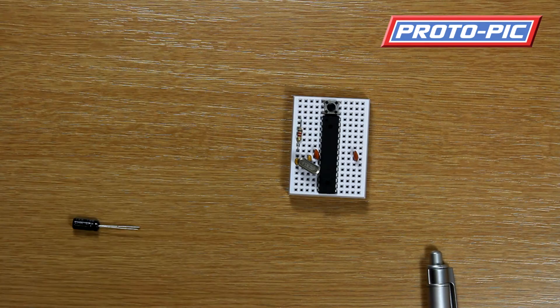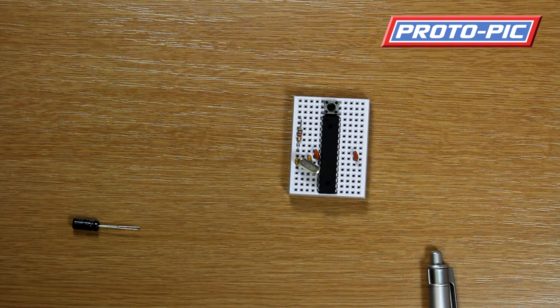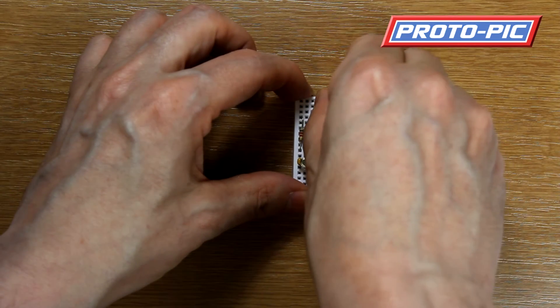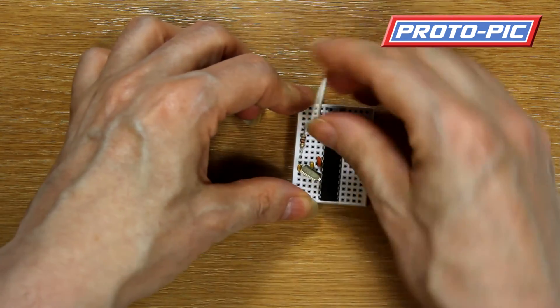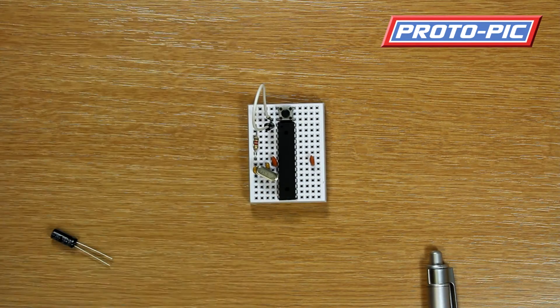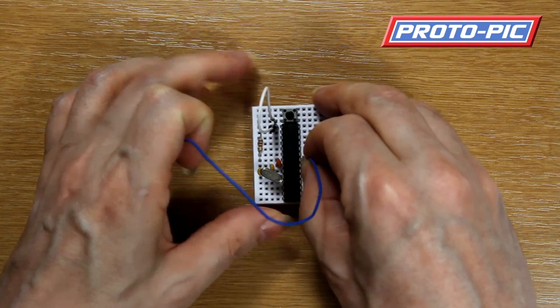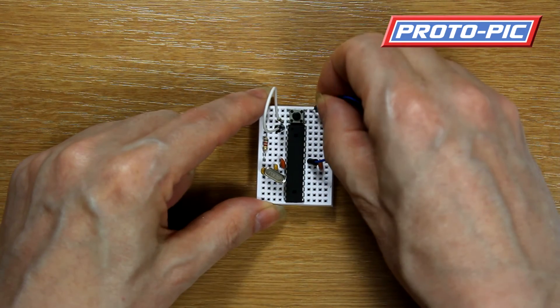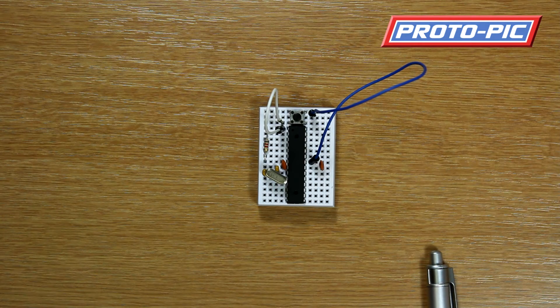Now that's basically everything you need other than installing jumper wires. As per the diagram, they go between the bottom of the reset button and pin 1 — I'll install that there. Jumper wires are not included in the kit, so you will either need to buy these from us; the jumper wire kits are available on the website. You can also just use off-cuts of wire. The next wire goes from the top of the orange capacitor up to the top right-hand pin of the reset button.